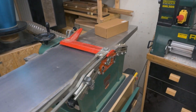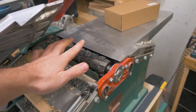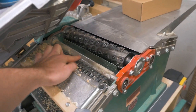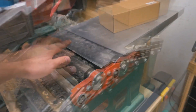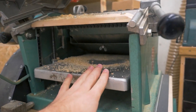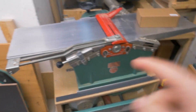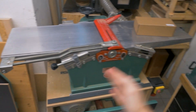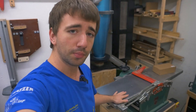I have another upgrade for my jointer planer in mind. A couple of years ago I made a few videos about upgrading its cutter head with a spiral one, and in that I had to replace the infeed roller with a knurled one. The outfeed roller is the original, but the infeed roller is not ideal — it slips from time to time because debris quickly clogs it up and then it doesn't have good grip on the wood. Also, the thickness table is relatively short and I want it a lot longer. That could be another pretty interesting project.